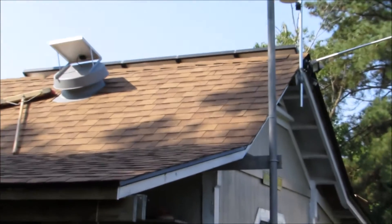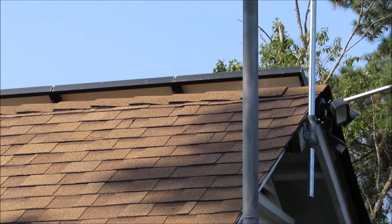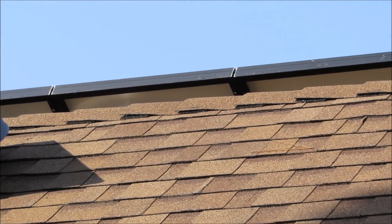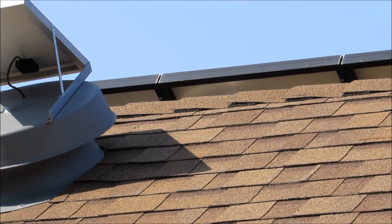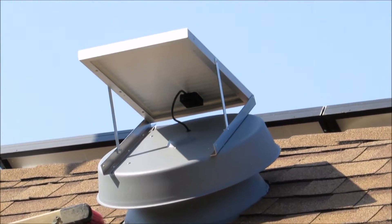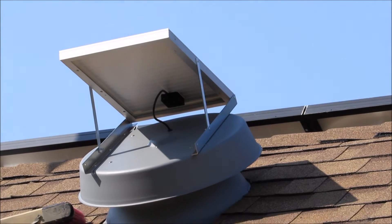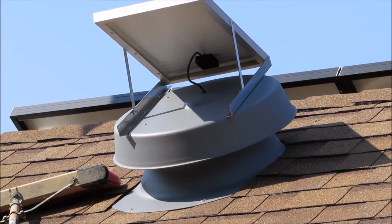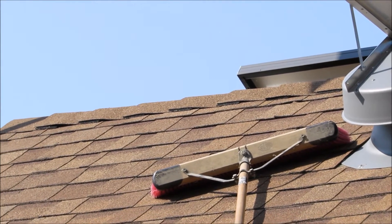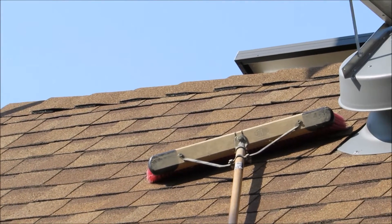Here's a view of the panels from the back, from the north side. You can see the clearance — they're flush, a little bit below the ridge cap. We'll have six up there altogether. There is the natural light solar attic fan. I raised it a little higher to get optimal airflow from the solar, pointed toward the south as much as possible. That's the flex cap for our electrical service entrance for the PV — for the photovoltaics.